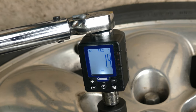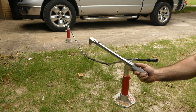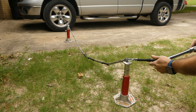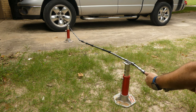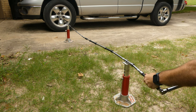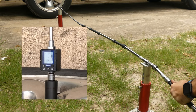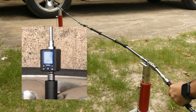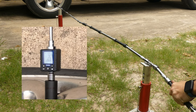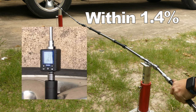When the 3/8 clicks at 30, the torque indicator reads about 27.5 foot-pounds. You can see all the extensions starting to rise up as they tension and take out all the play. After torquing 11 feet of miscellaneous extensions, the indicator shows 26.5 to 27.2 — not bad at all.